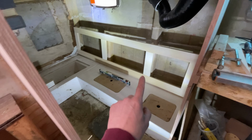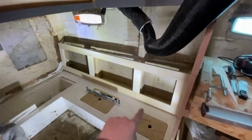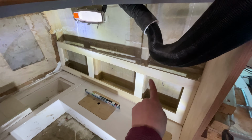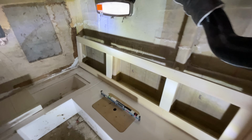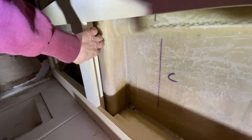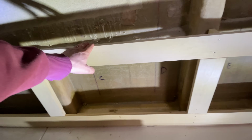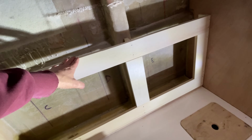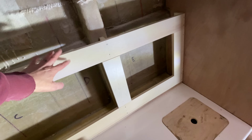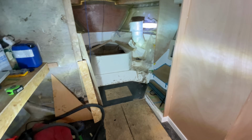So I've created this frame in here as well, still got the top piece to make for that. Same deal again, just two horizontal frames, these infill pieces scribed onto these stringers. So you can see here we've got these vertical pieces, left a 10-15mm gap behind, to be able to glass them onto there, again nice and strong. So that just all wants bonding together, so we'll glue this all together, we'll resin the back and paint the front.